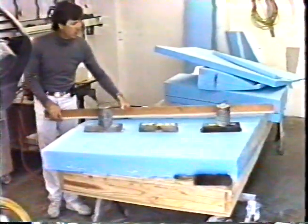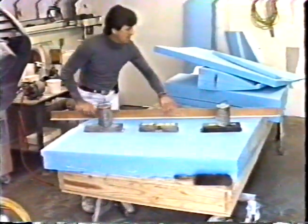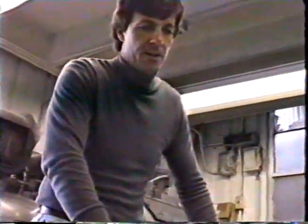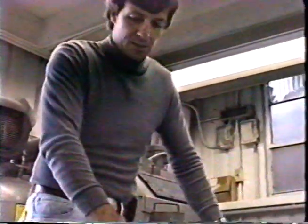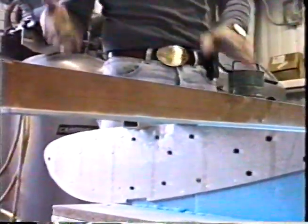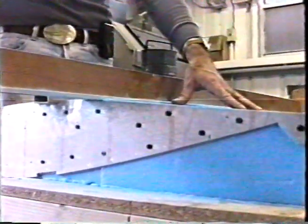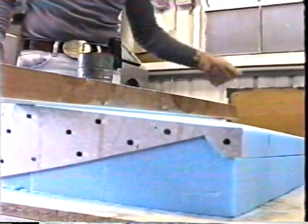We're not going to show you the other wing sand downs because they're identical to this one. But we are going to go to the next process, which is cutting the leading edges off. We're going to show you some things that you need to address that may not be immediately obvious. The rib that I'm pointing at here is BL 55.5, and the core section is the most inboard section of the wing. The opposite end is BL 23, which is adjacent to the engine compartment, the cowling.